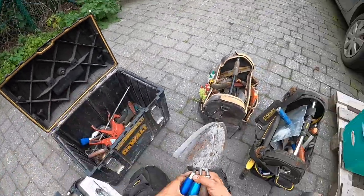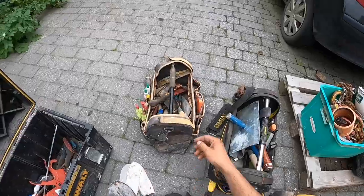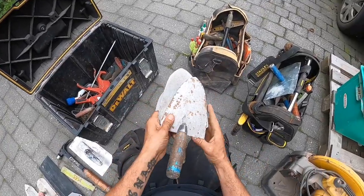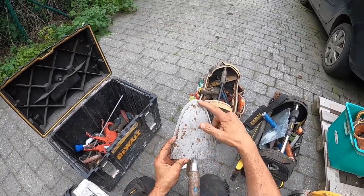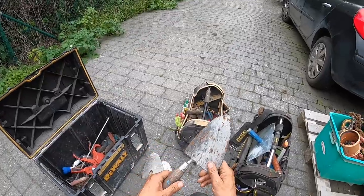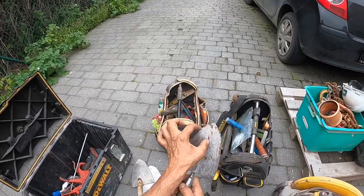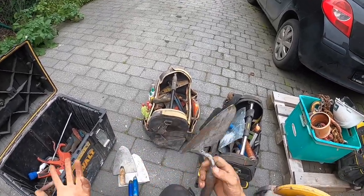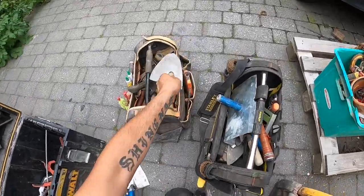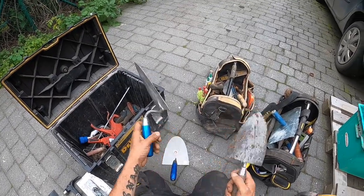I have some more trowels I don't carry out. This is the smallest one, the 180. If I take my medium one — 190 — it's like one centimeter shorter but the difference feels bigger. This trowel I only use for gluing or thin bed mortar, because with thin bed mortar you only have a small amount of mortar and this one is good to pick and dip. It's my main trowel now. This is another Brussels model, a spare one — I've got too many trowels.